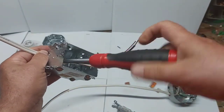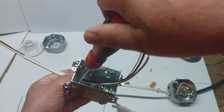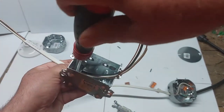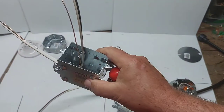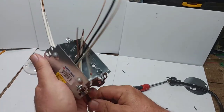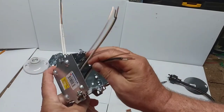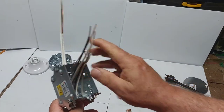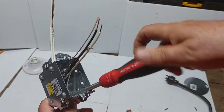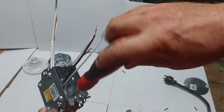Tighten the clamp down. This electrical box has clamps built right into it. The 14-2 wire has a ground, a hot wire, and a neutral wire — this one is coming from the power source. When clamping, make sure you're clamping on the plastic sheathing of the wire so it doesn't damage the wires going inside the box.